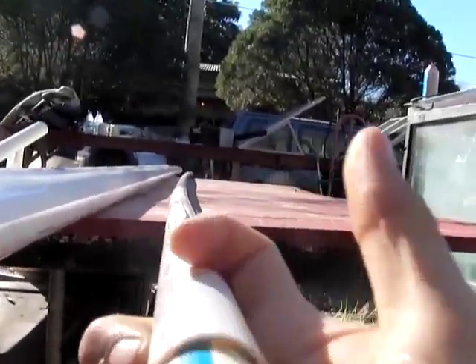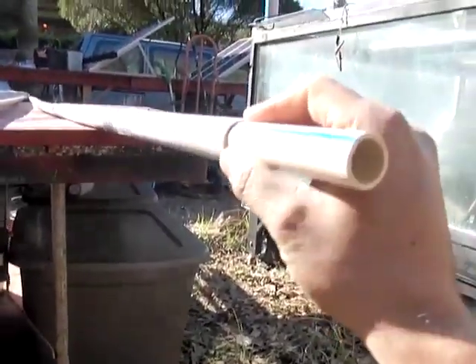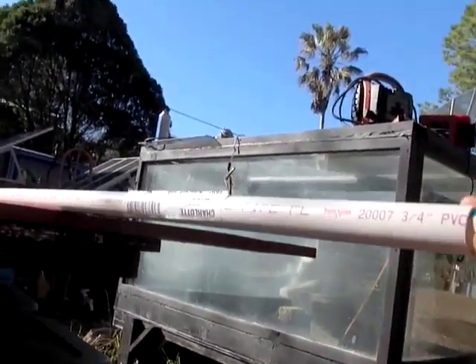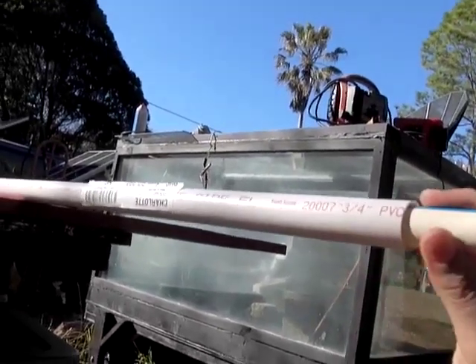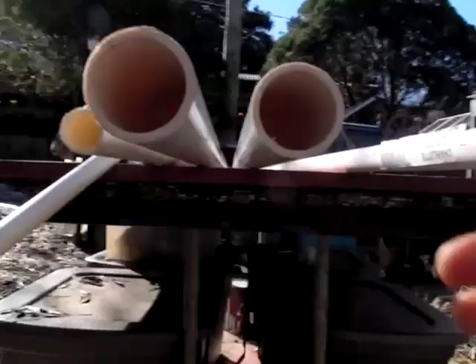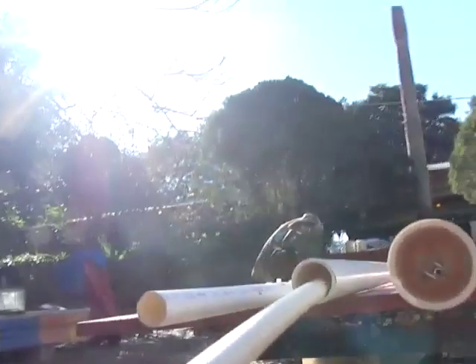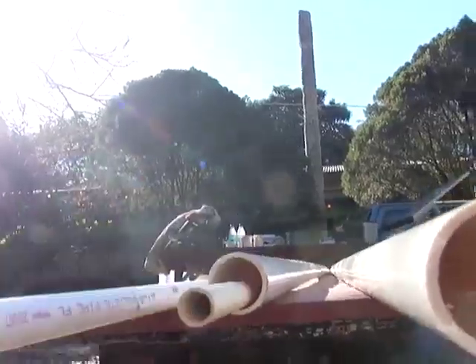This piece will slide all the way down and you end up with the CPVC inside. It's not a perfect fit — it's a little baggy. Thicker walled three quarter inch PVC fits too snug; you actually have to sand it down a little bit to get it to fit, so I like to use the thin walled for this project. What we're going to be doing is putting our CPVC inside of a piece of regular PVC like this, and we're going to create a vacuum around it.